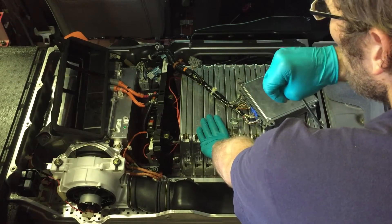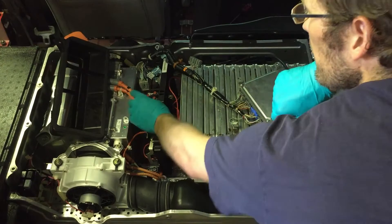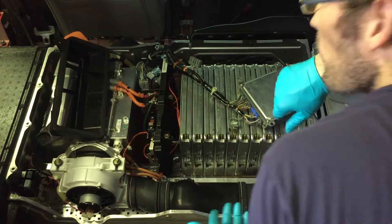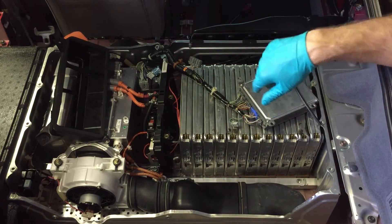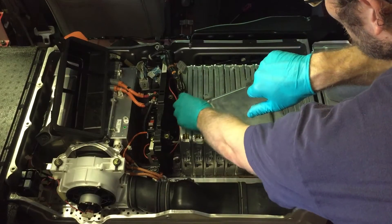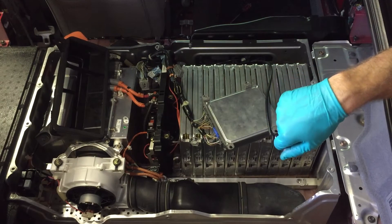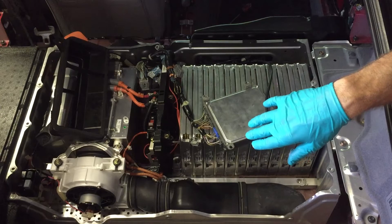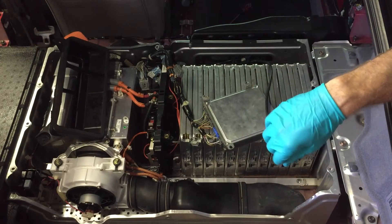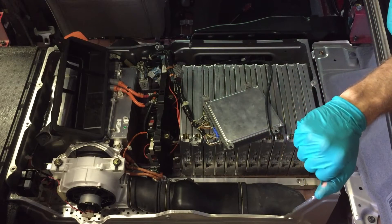It does fit. The one remaining concern with the 48S configuration is RF noise from the DC leads. These cables are actually shielded to about right here, but the cables we're going to put on there probably won't be shielded. If we do run into issues with noise, I can vet that out with a scope to see if we get noise on the lines since they're running in parallel. If we do get noise, we'll have to use shielded leads. This is only for the 48S configuration — the 36S keeps the wires kind of out of the way; they don't really cross and travel in parallel.